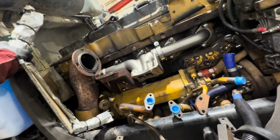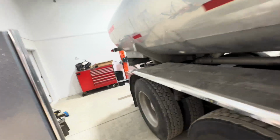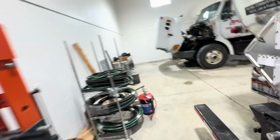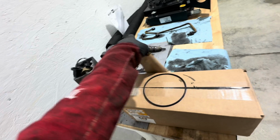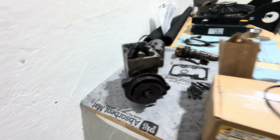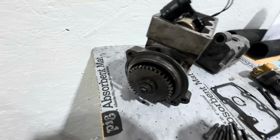I finish up here. I have this other tree truck over there. I have an injector that I need to replace. I need to run the overhead on it. The Huey pump was installed without the seal on it. I have the seal, I have the injector. I need to do the fuel return on it. But yeah, this was a significant leak because someone didn't install this gasket, or O-ring, sorry.